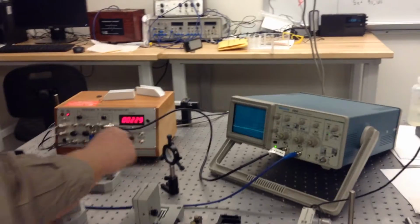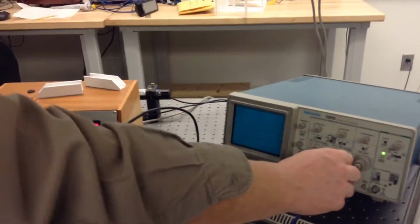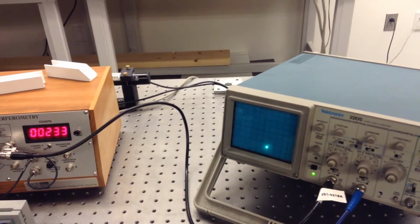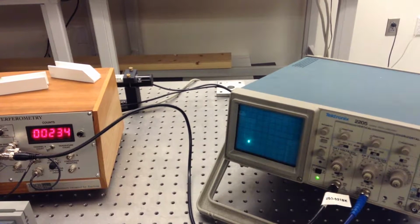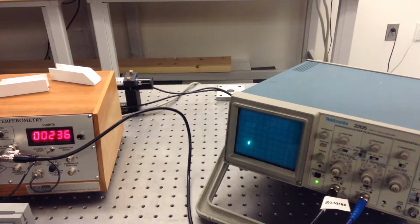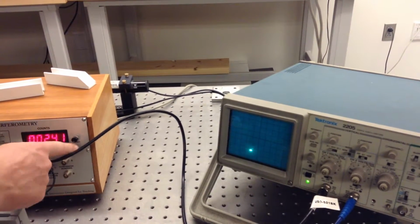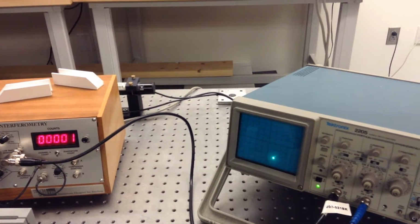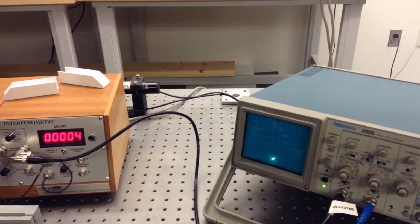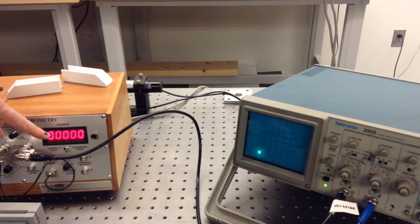If you look at the camera, we can put the output from these two detectors into the XY. And now what we have is this. We can see that the detectors are getting bright. They're completely out of phase, and there's a phase relationship between them. And if I switch this to quadrature count and reset it, watch what happens. When I go counterclockwise, the counter increases. When I go clockwise, the counter decreases.